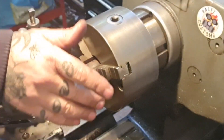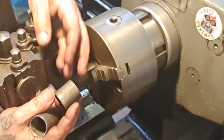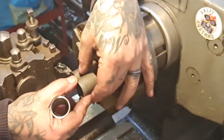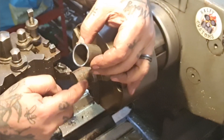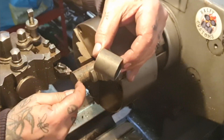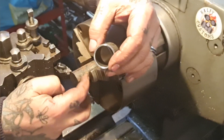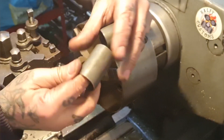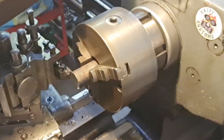Right, now onto the solid. We've got the tubes for each section - that's the spacer that goes over this mounting bar. And then you've got this with the bushes in that's got your blade on that does the action. We need to get them to fit on here. First thing I'm going to do is face both ends of this off, and then I'm going to turn myself a 32mm shoulder that just fits inside this tube nicely. Then we'll machine the rest of the diameter down to go through the bushes and to fit inside the foot peg that I'm yet to machine. We'll face off, spin it round, face off again - what is it? Let's have a look.